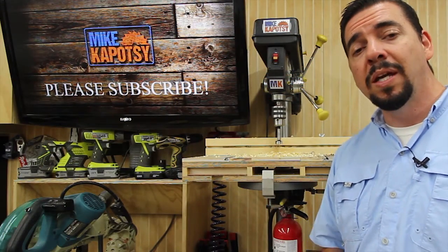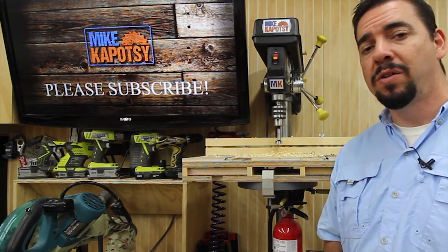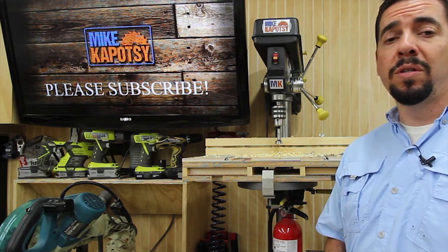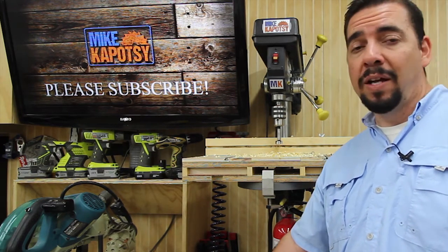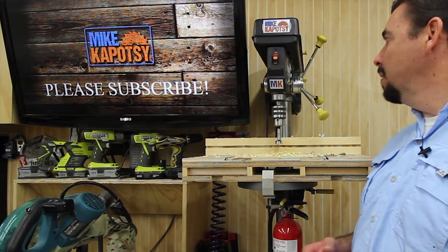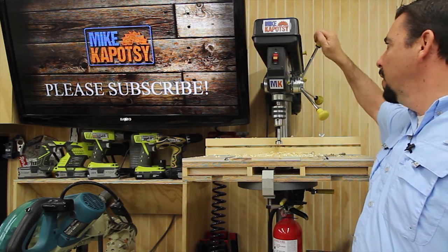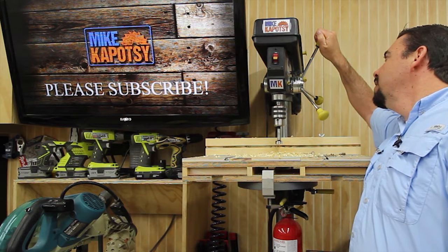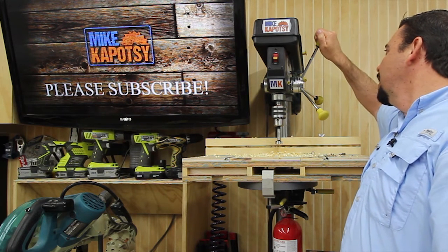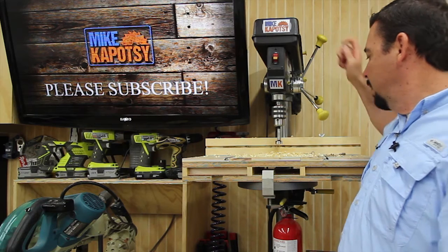The tool I'm talking about this week is my benchtop drill press. For years I had a Craftsman stand-up drill press that was my father's, but in my previous shop I didn't have adequate floor space, so I decided to sell it and purchase a benchtop version. Jay Bates had this particular press and said for the money it was really not a bad press, so I decided to buy this one. It is the 13-inch benchtop press from Harbor Freight — it's a Central Machinery. It's got speeds ranging from 220 RPM all the way up to 3600 RPM, so it's a 16-speed. The chuck capacity goes all the way up to 5/8 inch, and the table tilts from 0 to 45 degrees.